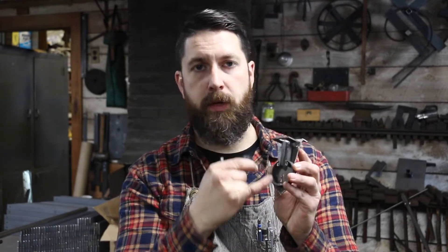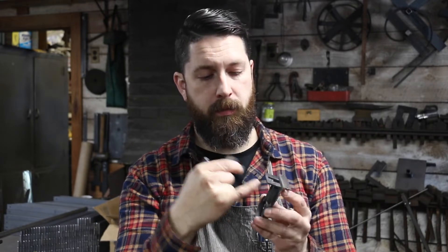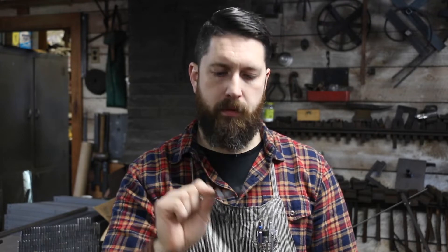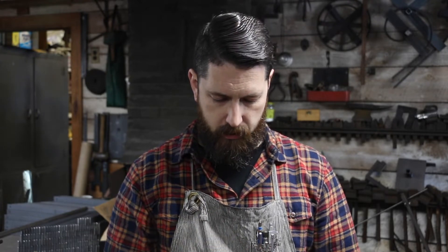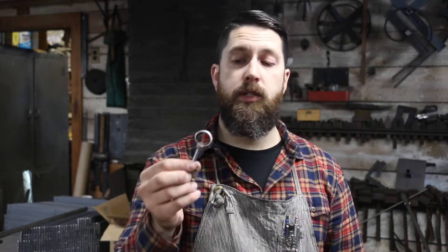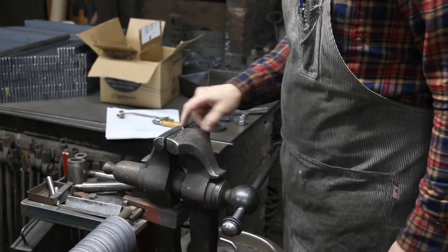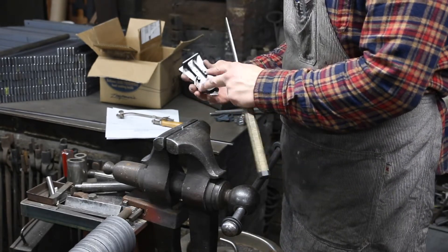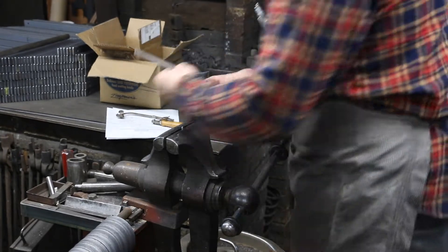So I've got a new main plate. The spring is the same. The jaws are new so those will need to be filed, but I've got them fit in. I'm using the same ward box. I made a new cover plate and the tumblers are new. I am also reusing the original key. So I'm just quickly making a post for the two tumblers to pivot around between the two jaws, just kind of filing up a tenon real quick.